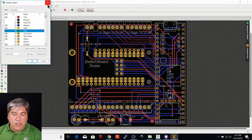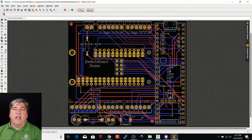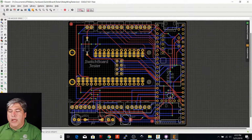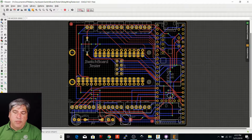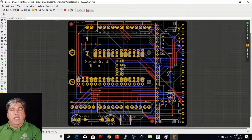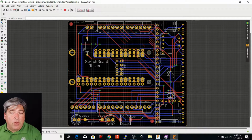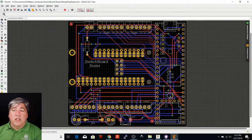Turn those vias on so you can see them. And I thought, okay, well, what would it take? This doesn't have any components that aren't through-hole components, right? They're all things that I can easily solder onto them. I can put the headers on the Teensy, I can pop that in it, I can put on the 2 resistors and the 2 LEDs and the button. Those are easy. So I don't need anybody in China or a PCBWay or Macrofab to assemble this. I just need a PCB board so that I don't have to do all of that wiring, right? What is it going to take?